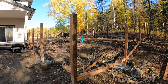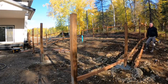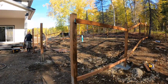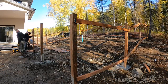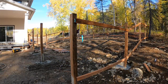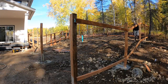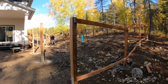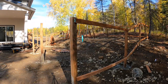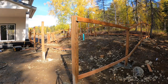With that next post up, we're basically just measuring four feet from that first cross post all the way up, so it's four feet separation. Some people put a third one in, but we're not really needing it for this one — it's pretty sturdy on its own. Once we get all these put up, I went around and just made sure they're all cut off so all the posts look nice and even. Some of them we couldn't get the full three feet, so they stuck a few inches higher — got all those cut off. Makes it look nice and even all the way around.